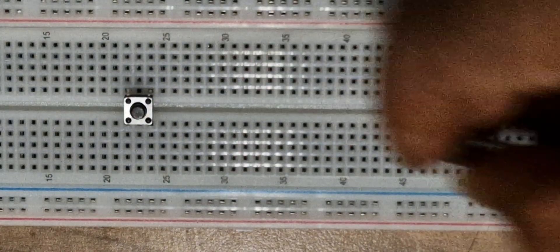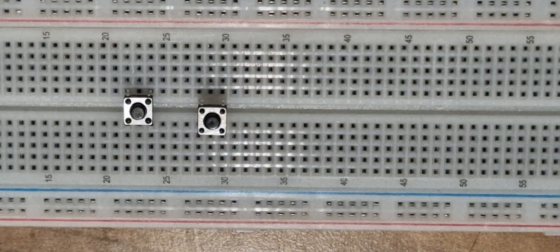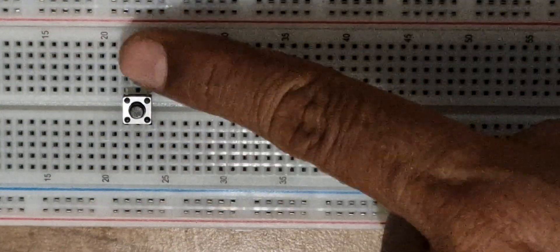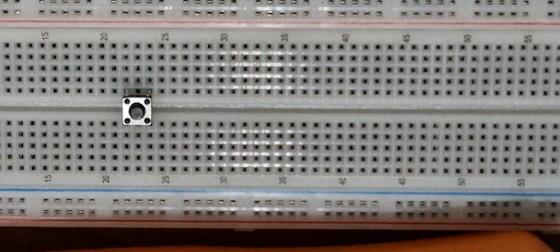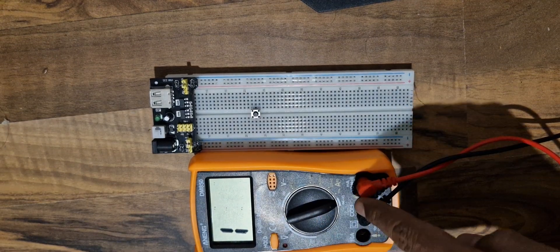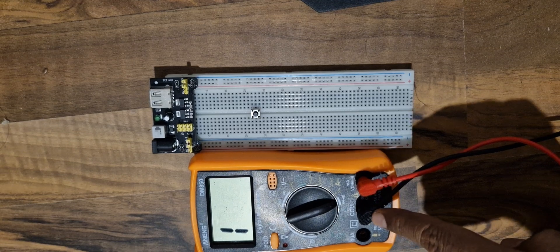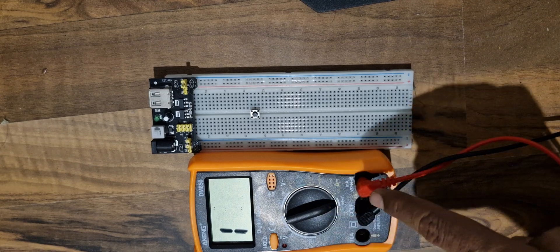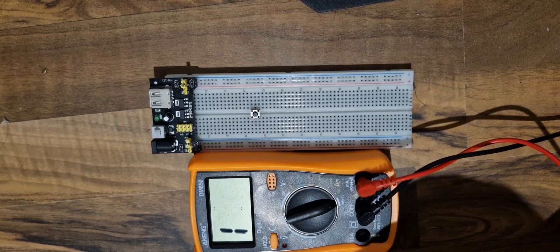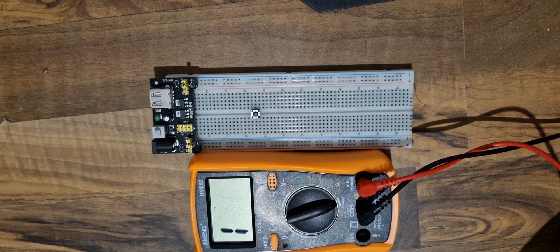I have put this switch in this fashion: two legs are on this side and two legs are on the right side. So two metal legs are on this side and two metal legs are on the other side. I am going to use a multimeter now. You can see I have this multimeter and I have set the knob to the continuity test. The red probe is connected here, the black probe is connected here. The sign shows milliamp, volt, ohm, and there is a buzzer sign — that is the continuity test. The knob is selected at the continuity position, which shows a diode symbol and a buzzer symbol.